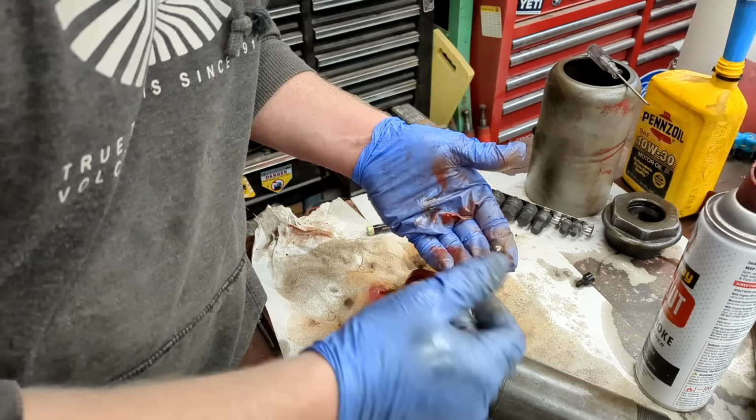This is my switching for my speed lift to the regular lift. So pull that out, I already pulled it out. It was leaking, and the reason it was leaking is because the O-ring that sits down right here is just a little bit brittle. So, not a big deal. We'll see if I can get the rest of the piston stuff out for you, just to show you.